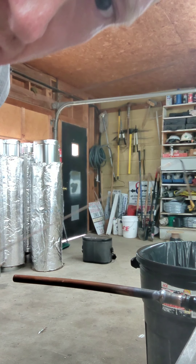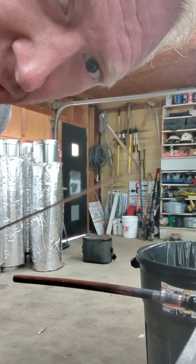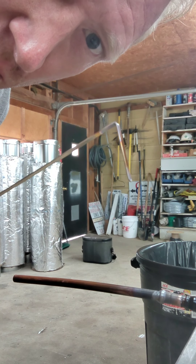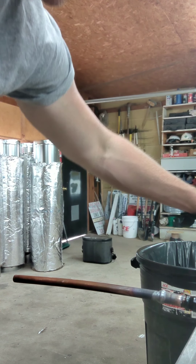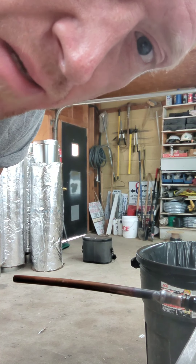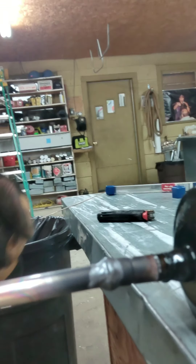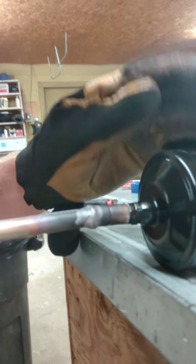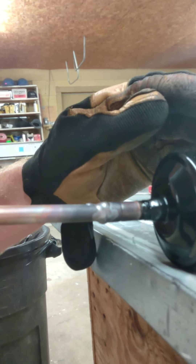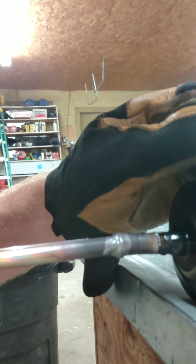It's just that quick and that easy, and that tip will go a long way in helping y'all when you get in the field when you can't access pipes and it's not easy. But that little hook on the end of that solder wire will definitely help things out. Look — it did here. Got it all the way on the bottom, 360 degrees. Perfect joint.